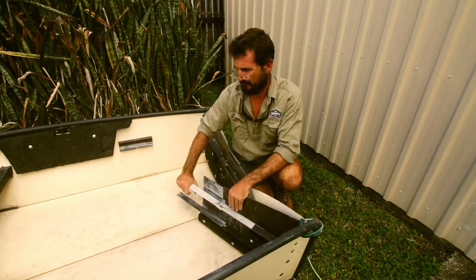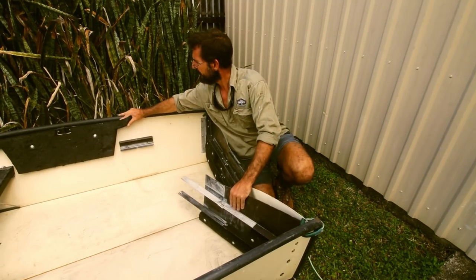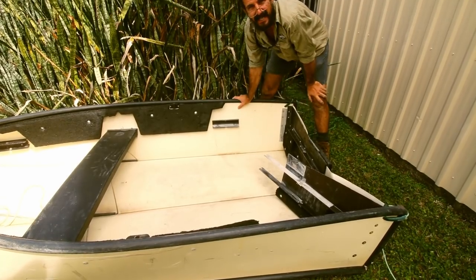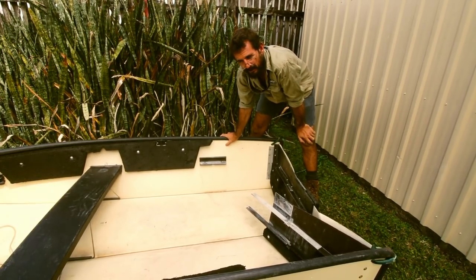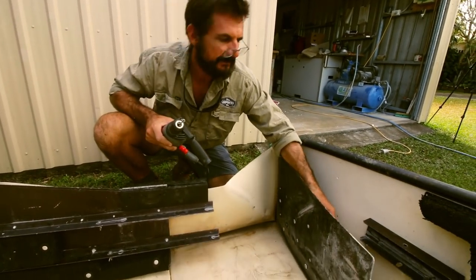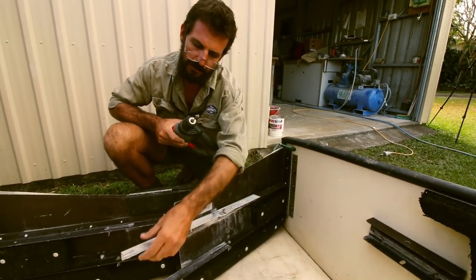This has been its Achilles heel: we've destroyed the seats, and the transom has had to have a few running repairs. The flotation foam is touted as UV-stable but it's been flaking off, coming apart, and generally looks pretty scabby. The manufacturers wanted to keep costs and weight down but needed, by law in many countries, to have reserve buoyancy in their boat — so this was their solution. So rivets are gone and it's floppy. We just need to take out these last ones here and make up a whole new section out of thicker aluminum.